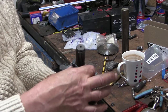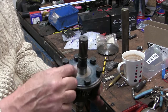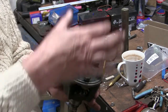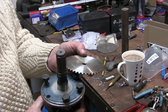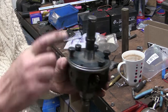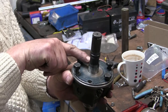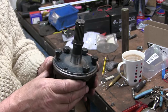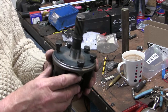And then a steel, about 2-inch round steel bit to go on there, and press the bearing into it. It's only got to be about 1/2 inch or so. The sprocket is going to have to go on that. But what I've got to be careful of now, because these are almost going to be flush with this bearing, is whether they'll be in the way of this sprocket. Bloody nuisance.